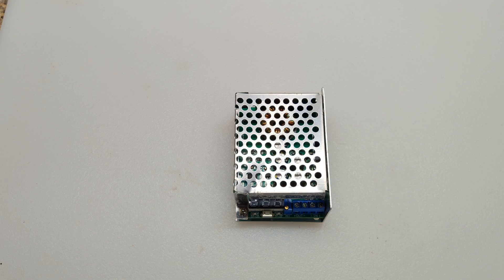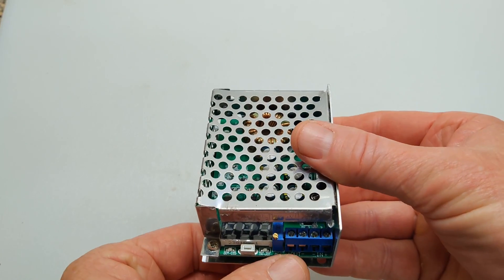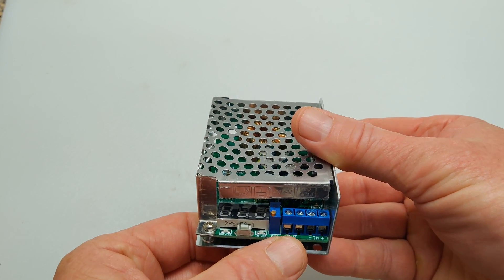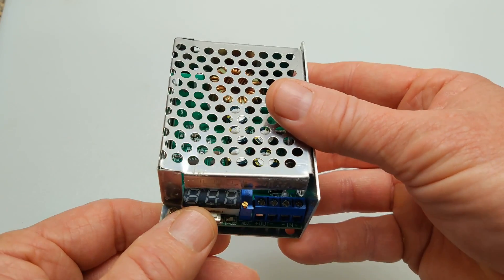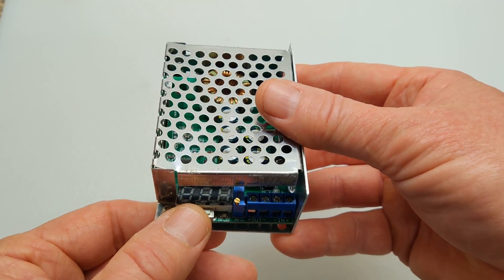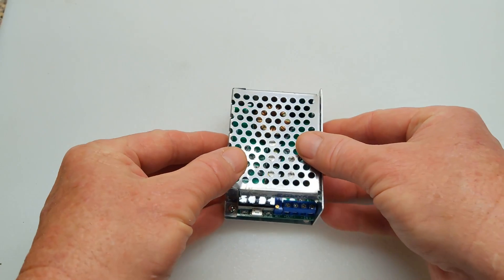This item is a DC buck converter step-down adjustable voltage regulator. I'm going to be using this to drop the 12-volt DC down to 5-volt DC, or close to it, so I can power the relay and the joystick, which is going to power the gearbox. Here are your two output terminals going to the relay, and your input is your battery connections. There's a little meter so you can see your output voltage, and this little screw is your adjustable screw that lets you change the voltage.